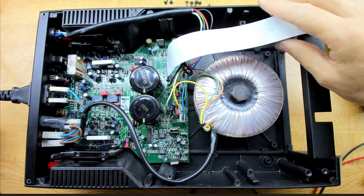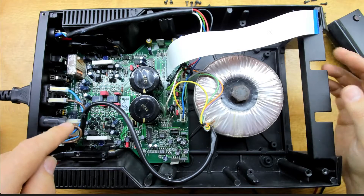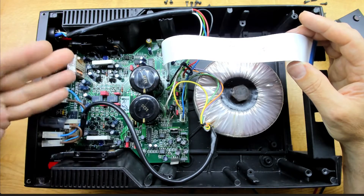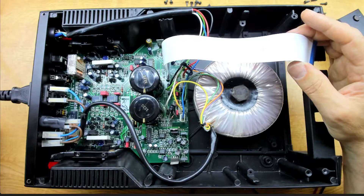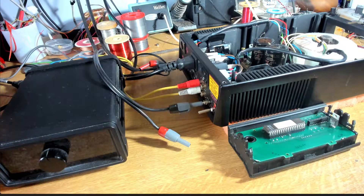Normally we'd give up at this point, but what I'm going to do is force the amplifier on. There's a control line down the ribbon that tells the amplifier to turn on, so we'll tie that line to 5 volts and power up the amplifier circuitry to do a quick check on whether the rest of the circuit is working. It took me a little while to get that working because I found a dead transistor on one of the current sources that was preventing it from turning on.